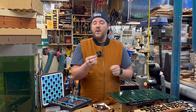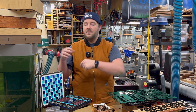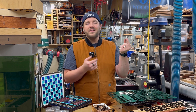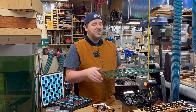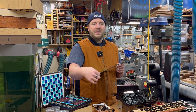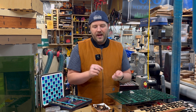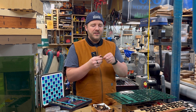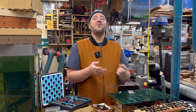With the wood, I ended up going a lot of different ways and just didn't want to take a chance because of wood movement - it expands and contracts. I didn't want this set sitting in someone's home to come apart. So I did glue - I tried wood glue and CA glue; between the two, CA glue is better because it dries clear. The sanding tip is going to really help. Biggest tip: just do like two or three pieces at a time and double check. Also, sometimes the friction fit really wears on your fingers, so a quick clamp was helpful, but sometimes it's too tight and you'll shatter. Plan for some losses.